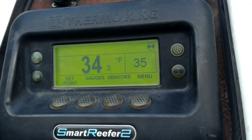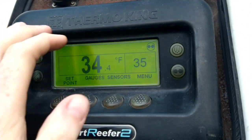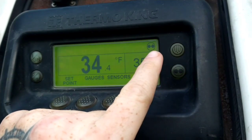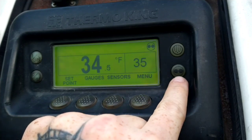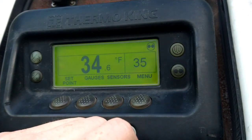We kicked off at 34.2 — that's cycle mode. It's going to let the temperature rise back up. If you want the reefer unit to run non-stop with no temperature variation, you would not put an ice cream load in start-and-stop. An ice cream load is going to be at negative 20 degrees and you leave that running continuously. You don't want the engine to turn off because it has to work so hard to maintain negative 20 — better to run at a steady rate.